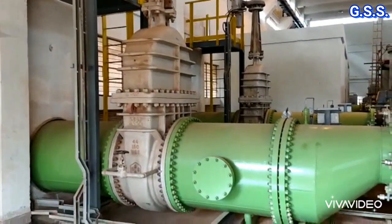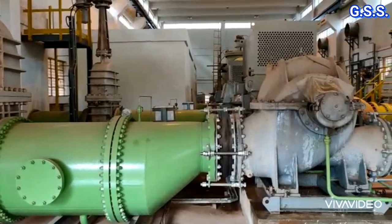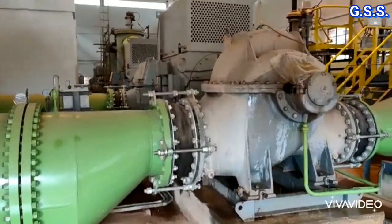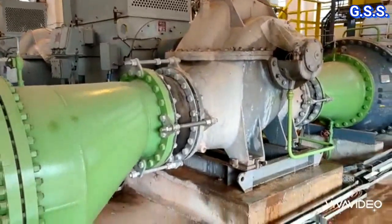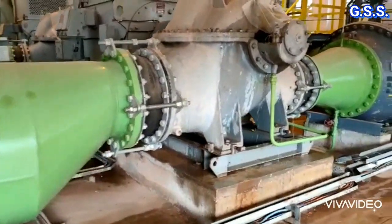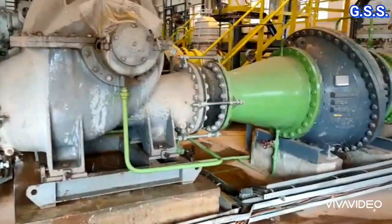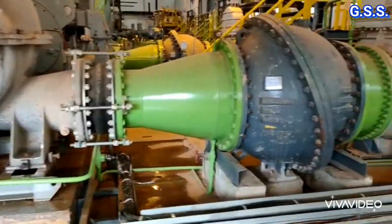This is another indoor installation of cooling water pumps inside a pump house. All items are there: suction isolation valve, conical strainer, eccentric reducer, rubber bellow on pump suction, then rubber bellow on pump discharge, discharge check valve and then discharge isolation valve.